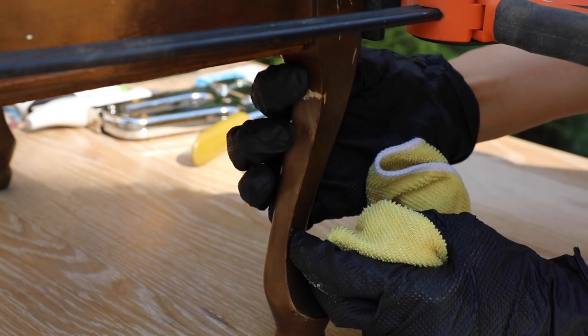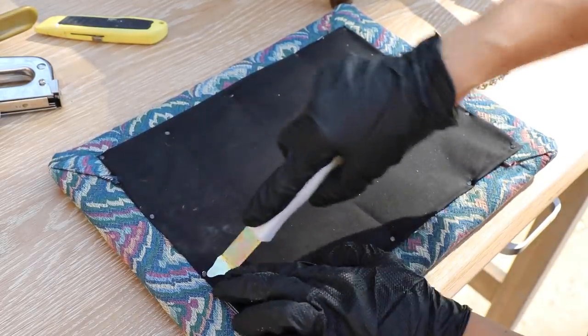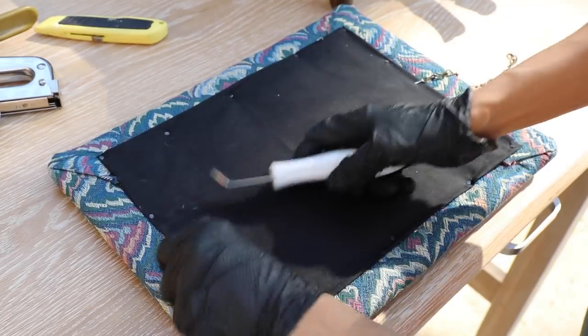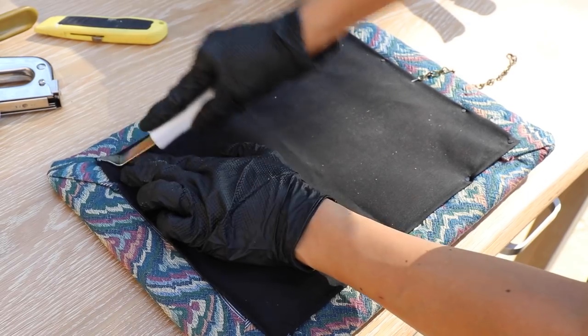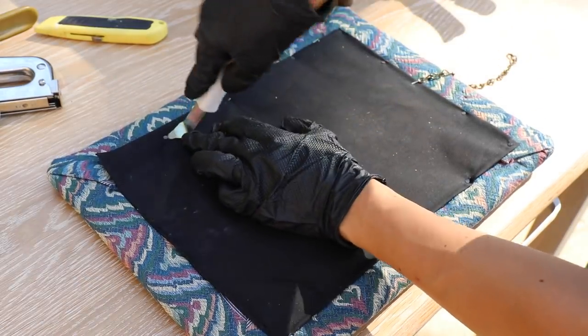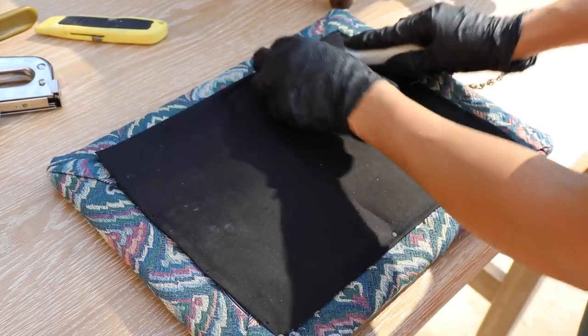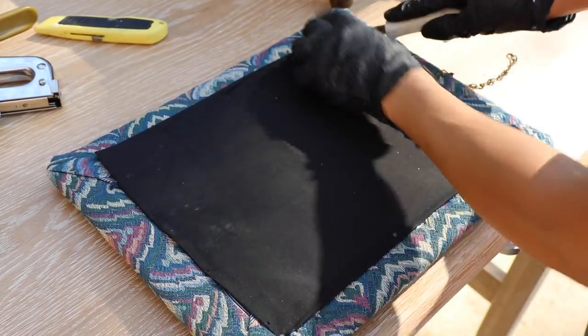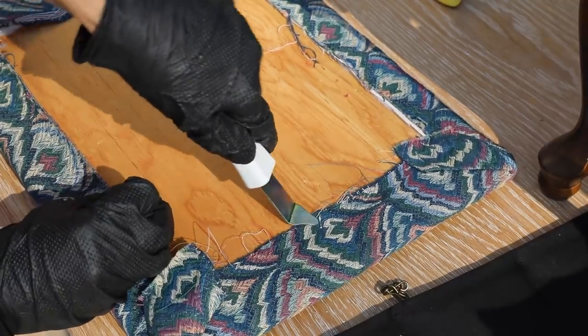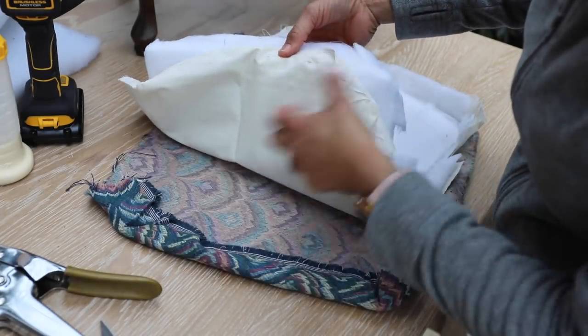Clean it up with a wet towel and get all those little drips. We can also use a little bit of wood filler before we paint. While the wood is drying, we're going to go ahead and start removing these tacks and staples to see what we're working with underneath. You don't have to use new batting, stuffing, or cushions if they're in good condition — reusing saves cost. If you know where the furniture comes from it's fine, but if you got it from a thrift store it can stink, so you may want to reupholster with new material.